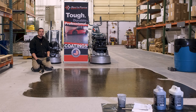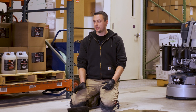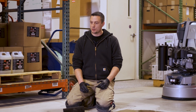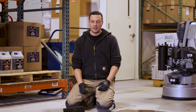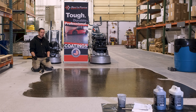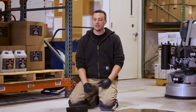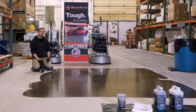To recap: there are two primary reasons to do the grout coat. One is with concrete polishing — you typically use a one-to-one polyurea, applied after your metals are done and prior to your transitionals. The purpose is to fill all the pores so that as you bring it up to a high gloss, you don't see those pores in your finished concrete polish, giving it a better mirror look. The other option is for epoxy floor systems — if you're trying to minimize outgassing with a neat floor system or metallic epoxy and you don't want bubbles and craters in your primer or body coat, you can do a grout coat with your MVB, the ResinForce Flake Shield MVB, either clear or pigmented, at about 600 to 800 square feet per gallon. Do that first, let it tack up, then put down 16 mils of that same product right on top wet on wet, and that will minimize outgassing as much as possible. If you have any questions, comment below or give us a call.